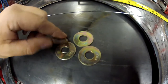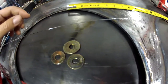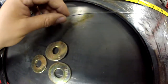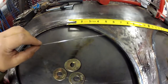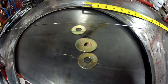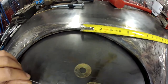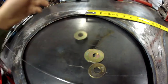As best as my research could come up with, these are actually made out of 4140, which is cromoly steel, and there are some special considerations when welding this, especially when joining it to a dissimilar type of steel. That's a 309 stainless filler rod I'm going to be using with the TIG — it's crack resistant, whereas 4140 is prone to cracking. So this rod will be a good option to join it. I'm also going to give it a little preheat; probably not necessary with something this thin, but that's the process.